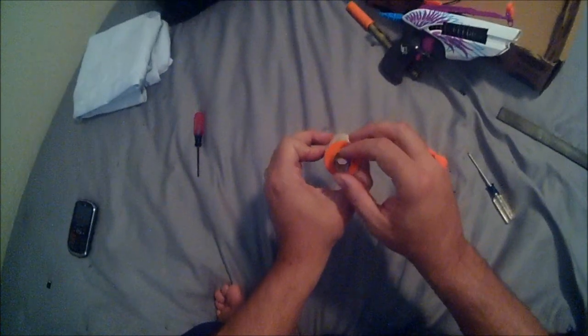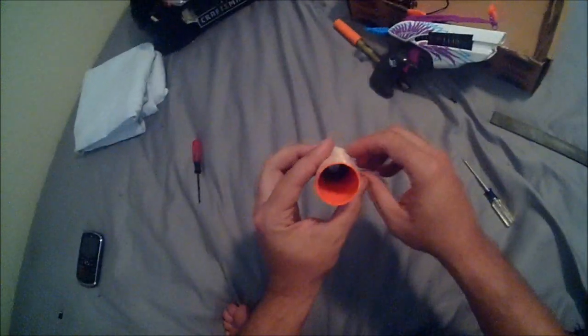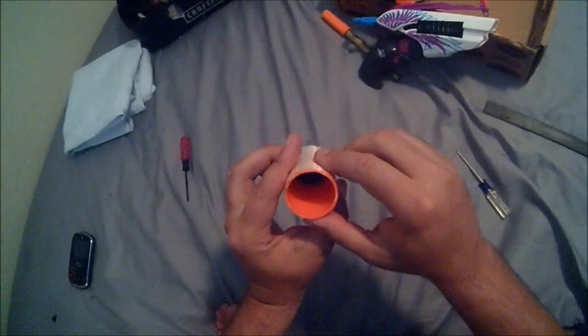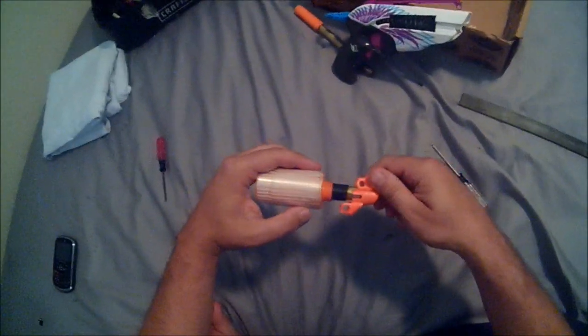Then you take a piece of 9/16 right here. You hone it right around there, and you glue it in with crazy glue. I use a little bit of silicone caulking on the inside of it, although that's actually grease and silicone caulking right there. But my silicone caulking is a lot smoother because I let it sit overnight. And then that's how you make your plunger tubes. Very small, about 60 cc's. But for a pistol, that's epic. That's for a little draw pistol. And then that is just held in like so.